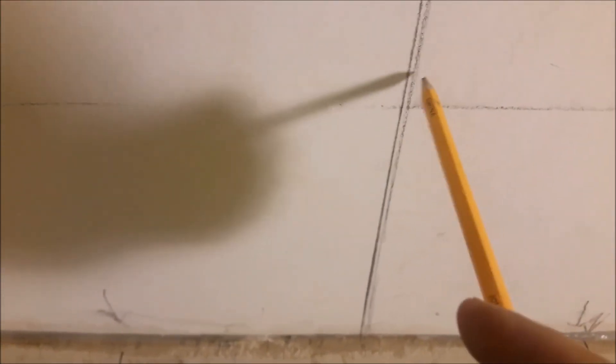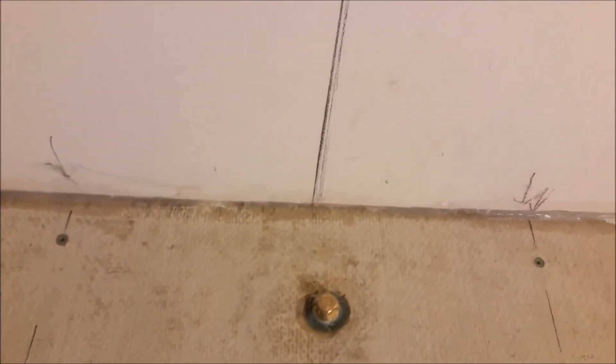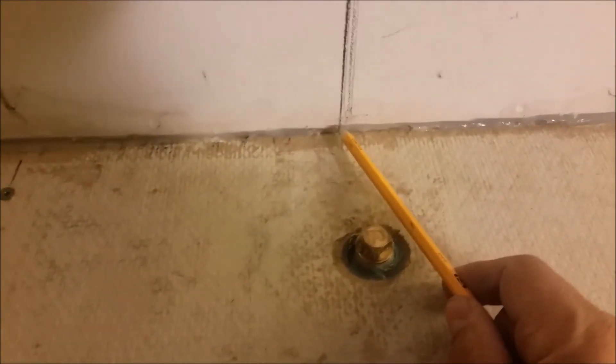Let me show you: this is the stick and this is the 90-degree line coming here. You can see two lines. This line to the right is the line that cuts the width exactly in half. But because I used this other line as my reference and took 90 degrees from it, you can see the imperfection of this rectangle — this ceiling area is not perfectly square. The difference between the two lines is a quarter of an inch. Just so you know how accurate the method is.